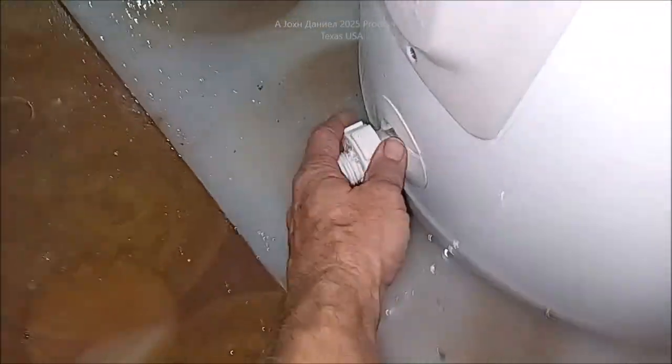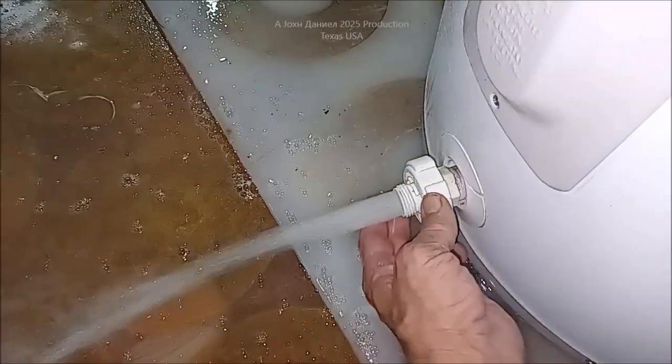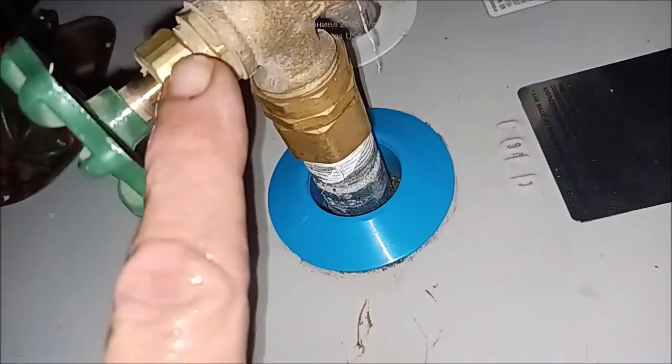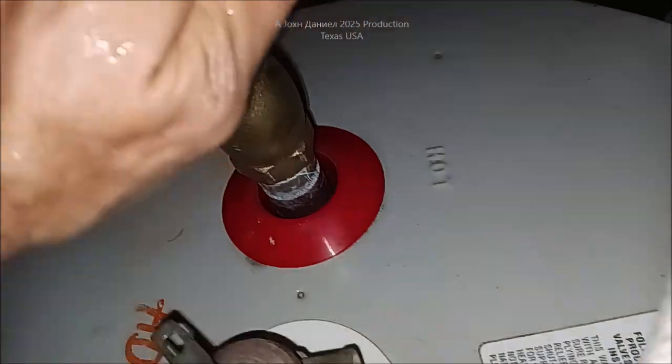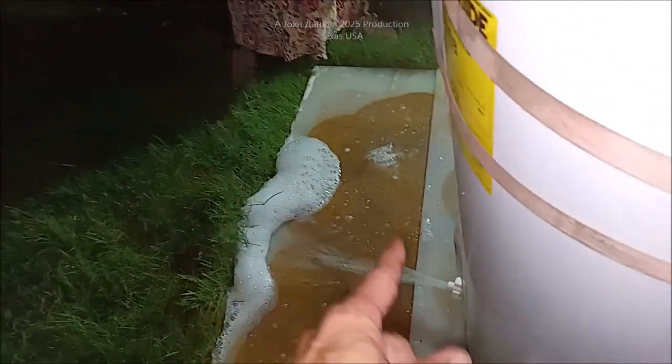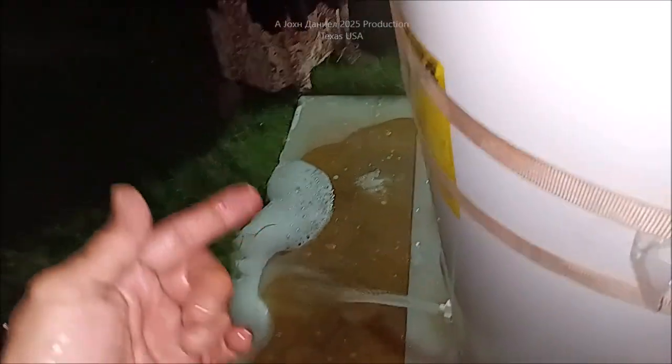My recommendation is that you open this valve down here. It's going to use a lot of water to do this. See all the pieces of stuff coming out? We're going to allow both valves to be on and keep the water running. We're going to let this water run until we don't see any more bubbles coming out. Then we're going to close it, fill it, and let it gravity drain one last time. Then it's ready for the next step.